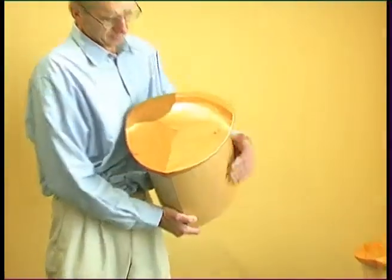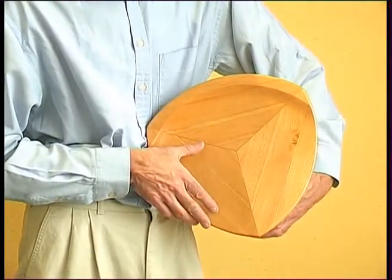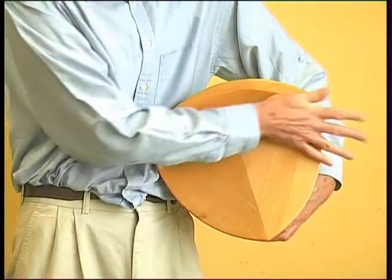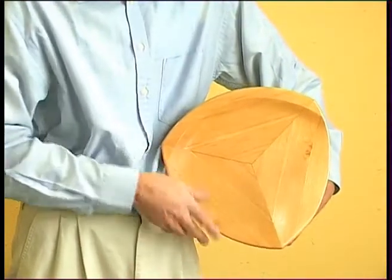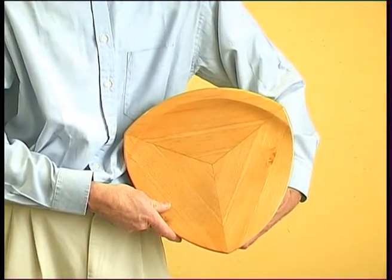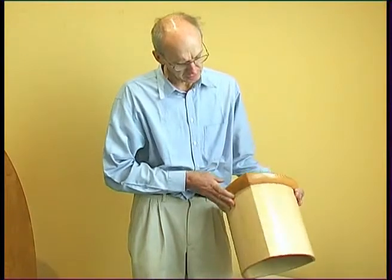The seats, there's very little waste material in the making up of this seat. As you can see, there are three members, and in fact, they are cut from one plank. That piece slides in there, that piece slides in there. So basically, this is cut from a triangular plank which has already been laminated up. The grain is aligned so that basically you have the equivalent of a quarter sawn plank for stability. Oregon, with its marked grain, lends itself very well to such a design and construction.